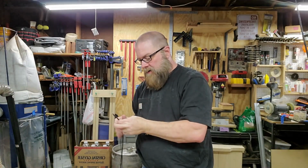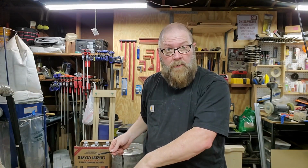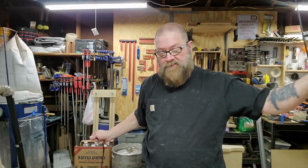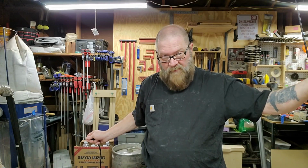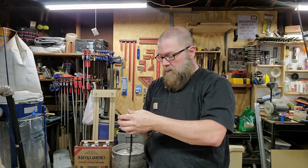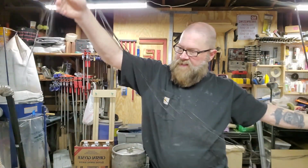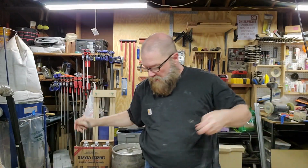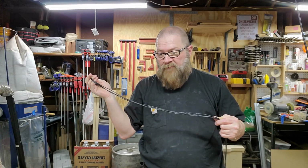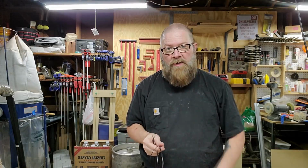Another little trick that I figured out is I take the spool of wire, and I've got the spool of wire on the floor. So I make the very first cut, the very first 3 meter radial, and I just pull from the floor and just keep making new ones. When I get to the end, I make my cuts so that everything is uniform in length, and we're ready to roll. So rather than bore you guys with watching me do this 3 or 4 more times, we're going to cut to the next section. So we'll see you shortly.